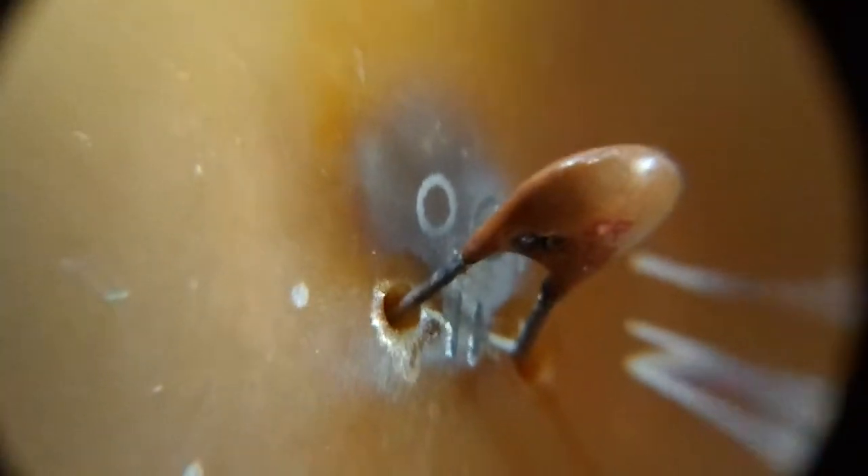So we're going to fix this just by replacing it with a regular 0.01 microfarad capacitor. And that's what we're going to do — just replace that.